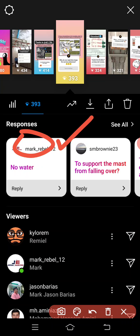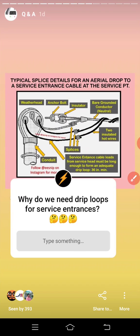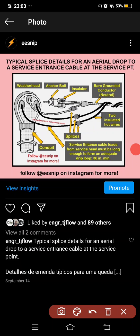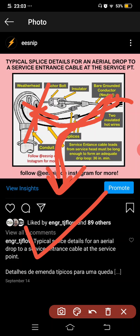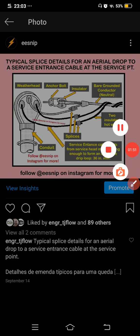Let me check the post here. For example, the water is going to flow here — since it is a lower point on this side, the water flows here instead of going into the conduit. It just goes down. So drip loops are needed and required for that. Thanks everyone — I hope you learned something new today!